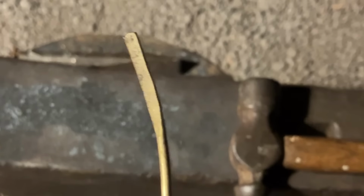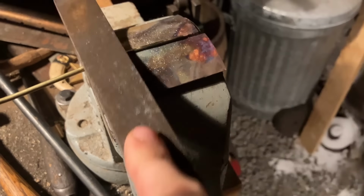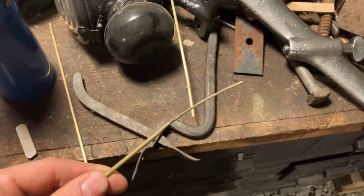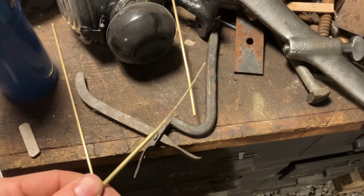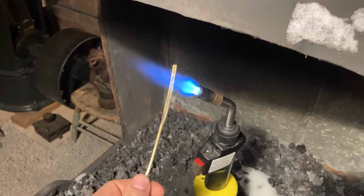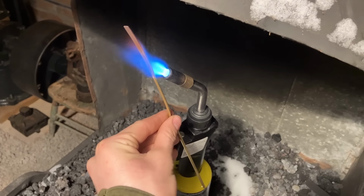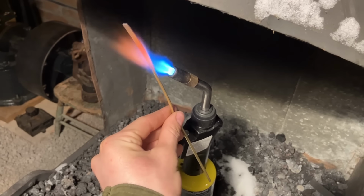And then it needed these little retaining rings to keep the loops that index with the clip latches tight together. So I flattened some of the same 1/8-inch bar on the anvil and then filed the edges so it looked like square or little flat strap stuff. And then went to the torch and annealed it.